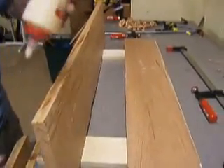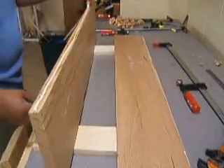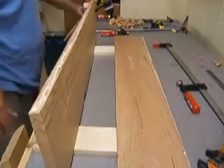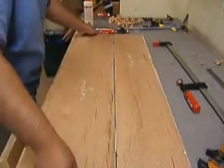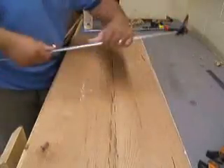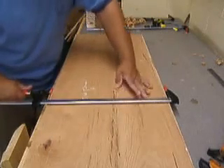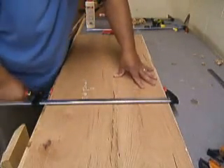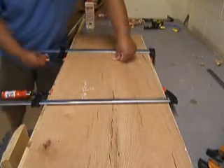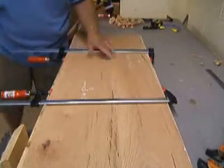Now let's do the actual glue-up. Taking some fresh glue, get it to the tip, apply just enough glue along the edge — don't apply too much, work it in. Set it aside, put a piece down, do a rub joint to get it in place. Since we have a sprung joint, we simply bring it right up. These are quick clamps that allow you to make quick adjustments. I've raised the board up off the table to make it easier for the clamps to be adjusted.